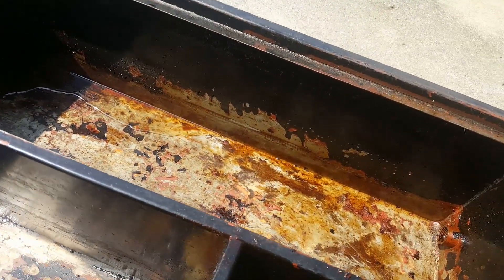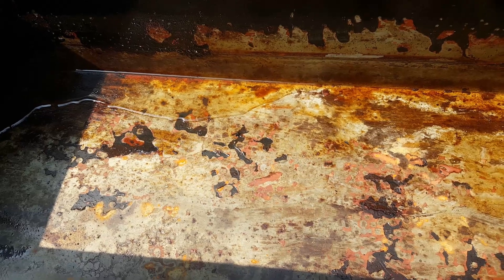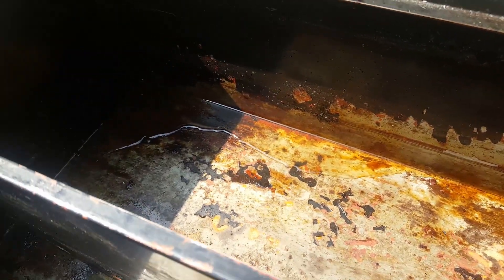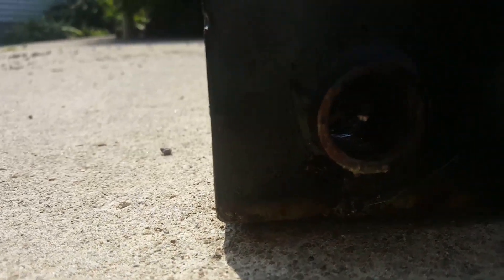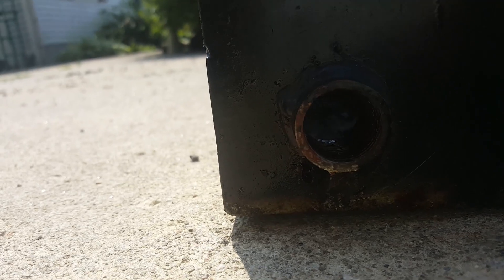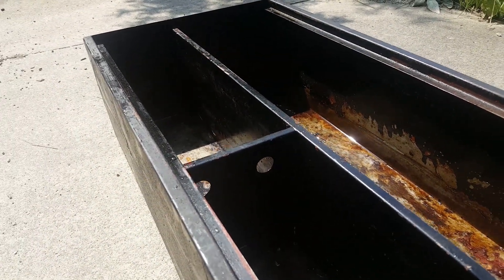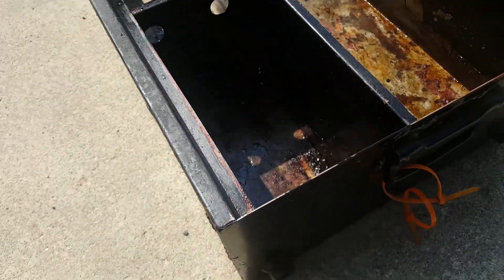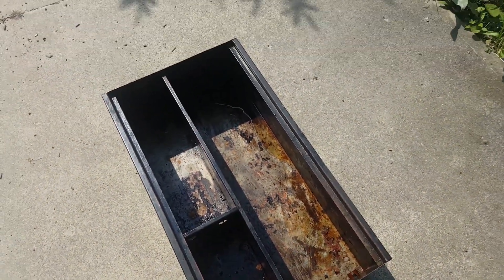You can see I just have it out here drying in the sun. Whatever coolant they had originally in here was emulsion — coolant that has oil atomized into it. And it ate away the paint, so I'm just trying to have it dry before it rusts. Another thing is there are little hex head screws that keep the oil in there, and when you want to drain the oil you just take those out. But they don't fit nicely at all. I put Teflon tape around them and even with Teflon tape they tended to leak, so I think I'm just going to epoxy that up. Because if not, I'm going to have a leak even with a lot of that tape.